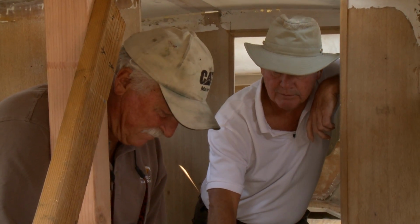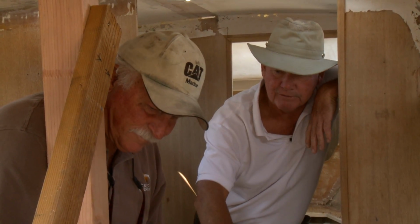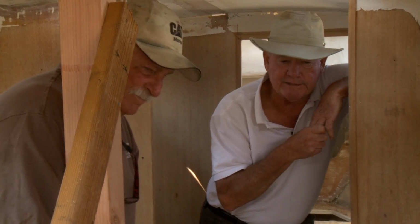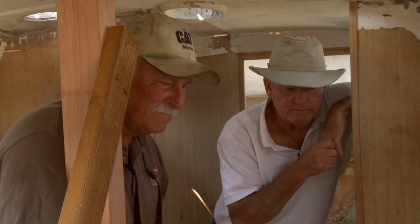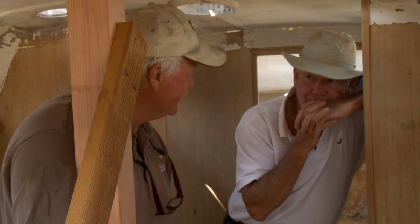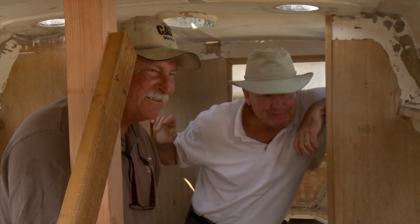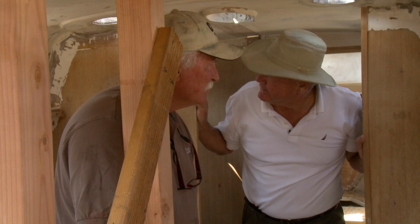And the other thing was this keel wagging, where you'd be sailing upwind and you could feel the floor moving around. Yeah, because these boats were built pretty fast and they were pretty light boats in their time and didn't take advantage of any coring at all. So when they first came out, all of these bonds were good, but they just worked and cracked and caused a problem.